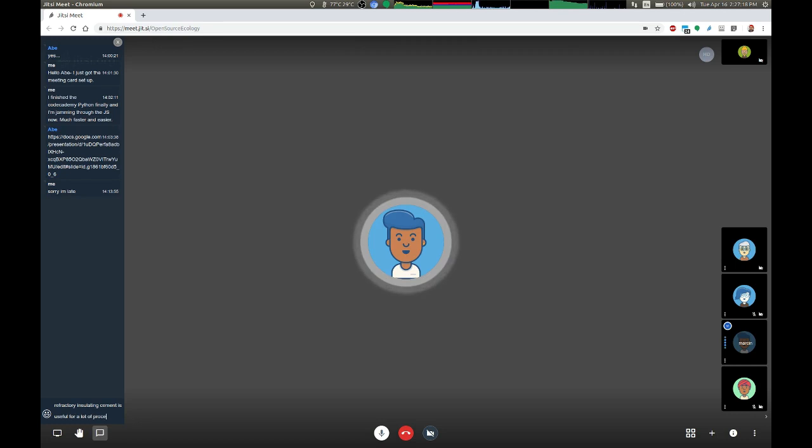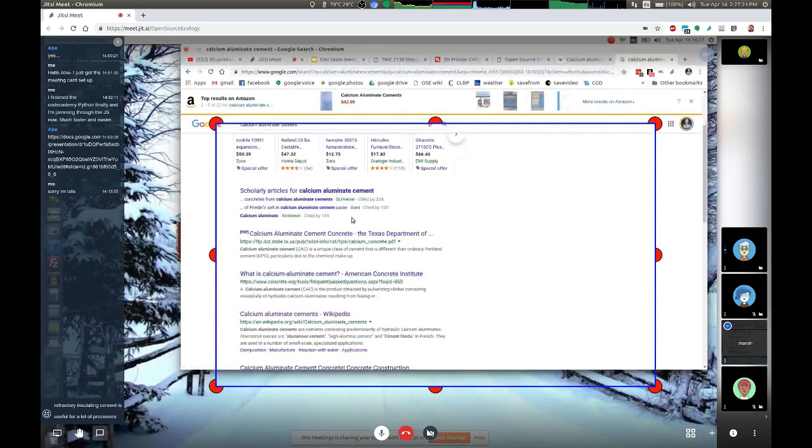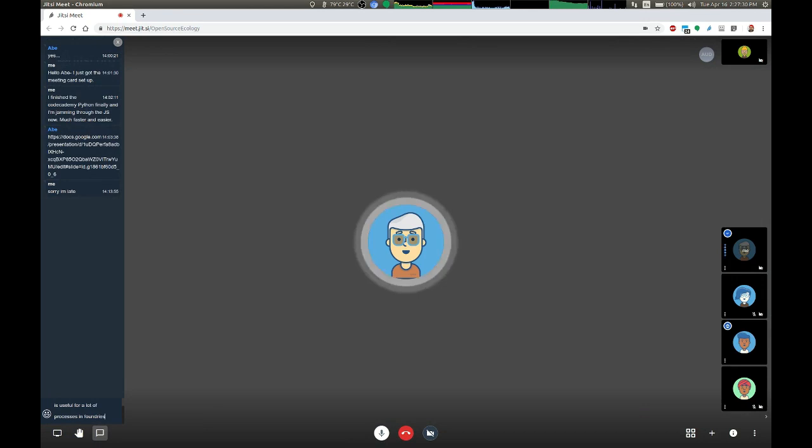The strength of this approach is the mold is highly accurate. For thermoplastic molding, it copies the mold very accurately. For steel casting, premium casting can actually get pretty good accuracy — around 50 to 80 microns over 10 centimeters — which is pretty good, with nice surface finishes. However, the accuracy you get depends on the specific casting process. There are various refractory materials available, and most will degrade slightly at steel casting temperatures, which can cause cracking and affect surface finish.